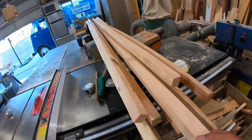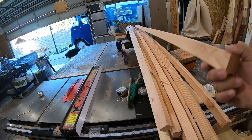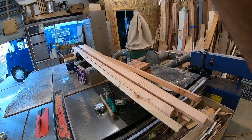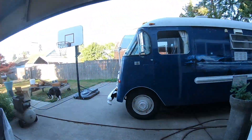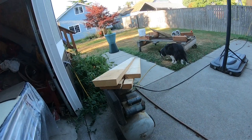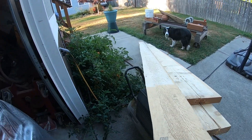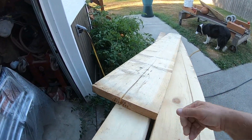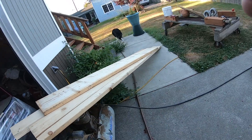We're back in the shop — we're going to mill up a little bit of that farm pack lumber that I got. This here is the offcut or waste from cutting those two by tens down for the blocking along the eaves where the bird blocks are. Those are going to work great underneath, in between the extensions or outriggers when I start doing the overhang for the gabled ends. I'm also going to mill a broken two by 12 into a two by six, and I've got these cracked two by 12s that I'm going to mill into two by fours for the butt blocks on the plywood floor.